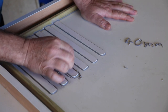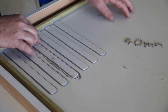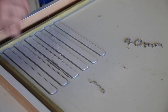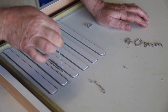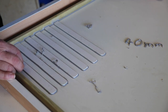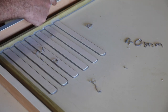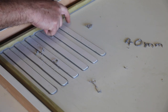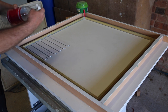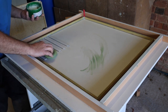The silicone has cured overnight. This is the advantage of having waxed: you still have to fight a little to get the excess silicone off, but it's a matter of grabbing hold of it and off it comes. Just to note: the depth of the top is going to be 40mm, so these pieces here are 40mm from the top of the shuttering to what will be the top surface — we'll end up with a 40mm thick top. Just coat everything to make sure the concrete releases from the mould nice and easily.